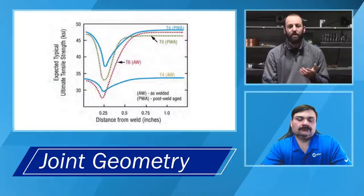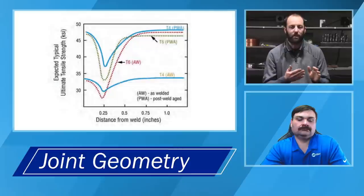And a lot of times with the aluminum-specific abrasives, what they're actually doing is they have some sort of a lubricant in them, similar to what a lot of people would do on a saw. It's essentially a hydrocarbon-based material that, as it gets hot, is creating a lubrication to prevent the aluminum from sticking to that disc or that wheel.